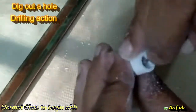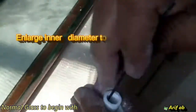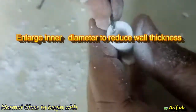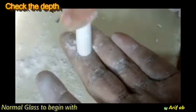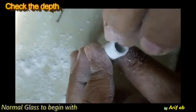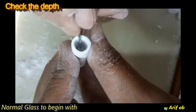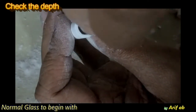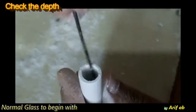Roughly I have achieved the required depth. It's similar to a drilling operation. Now I am reducing the thickness of the wall, which means I need to increase the inner diameter of the hole I drilled. You need to take care while increasing the inner diameter — the process should be slow so that it doesn't break.